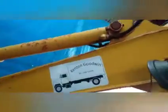And likewise for the top and the dipper boom and the bucket ram. So we'd like to replace all the rams on there. We're also going to clean up all these, and hopefully get these all nice and cleaned up. These two pipes here are actually for your pecker, which comes up the center here, and then I guess goes down the side. I don't know where it goes, but we're planning on getting fittings made up for them, and then having a hose just clamped in either side all the way up,